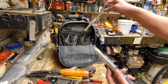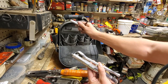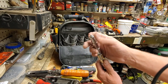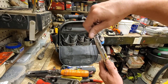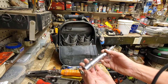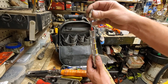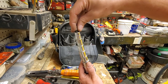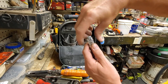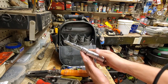I relegated an entire 12-piece socket set to this, and the extension is up in there. Here's a nifty little tip or trick. Quarter-inch all-thread, quarter-20 — 7/16" is the smallest size on here. Put a little nut and washer cap at the bottom, put some tape on it so it doesn't scratch against the threads, then put your 7/16" socket on there, put your nut on the top, lift the socket up, and tighten the whole thing down with the 7/16" socket. You have the most compact socket set you could possibly have.